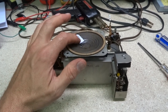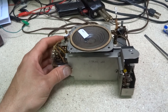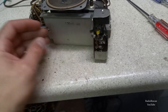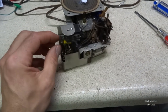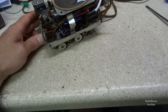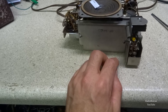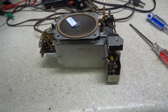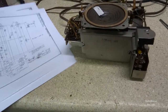Looks like somebody's done some patchwork on the speaker up here — put a piece of paper and some glue. He said he attempted to recap this thing and it didn't work after he got done with it — said it just picked up hash and didn't get much of anything. So I'll go through, get all these covers off so I can see everything, compare to the schematic, see what's been done, make sure everything's been done correctly, and then if that looks good we'll troubleshoot what's wrong.